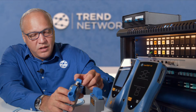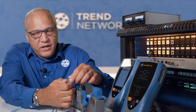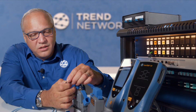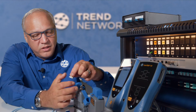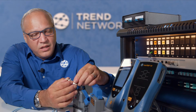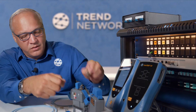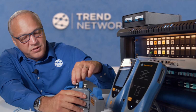You need to be taking off two pieces here. They usually come off together, but if I unthread this, oh, it's pretty tight. There we go. So we see that there's actually two pieces that should come off. This piece threads onto the FiberTEK module directly, and then the SC, ST, and FC adapters thread onto this piece. So we remove both of those and attach our LC adapter to the module.